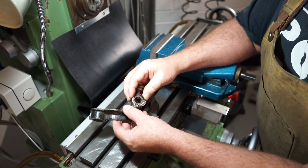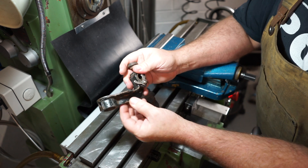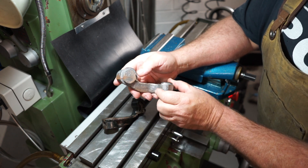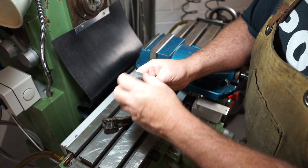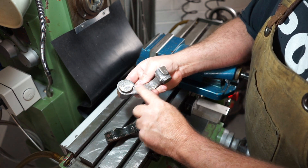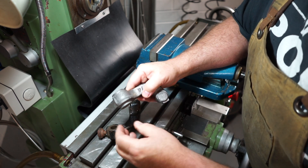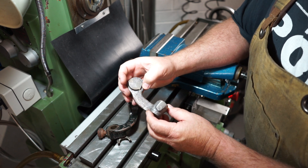How I'm going to hold this today - it's always hard holding these sort of weird parts. I do have this surface here and here that I can grab onto. If I look at the remanufactured part here, this was digitally scanned and then cast in a foundry. The gentleman I'm working for, Wayne, does the scanning himself and then he adds a little bit onto it here and here. So this one I'm pretty right - if I machine this down to this face it should be good to go. I'll probably have to take some metal off here and measure the width to get it exact. Right on, let's get into it.